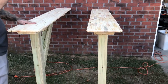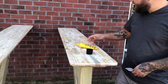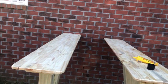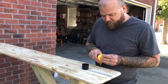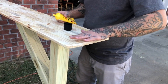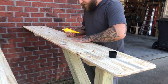It's sanded, so no one's going to get a splinter, and it'll get painted — it's going out on the deck. Danny, talk about what we've done. So we trued this out, drilled pilot holes, countersunk the screws, and dropped the screws in — nice and flat, super flat. Now I'm just going through and hitting wood filler on all of these screw heads because I'm a bit obsessive-compulsive.